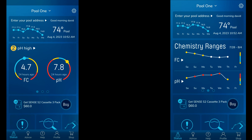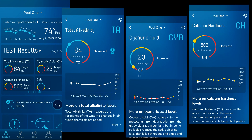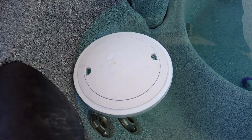Here are the readings for the week. Once I lowered my salt production, the free chlorine level has been dropping. On Wednesday I added acid to the pool, and you can see that reflected on Thursday with the pH at 7.8. Total alkalinity has been pretty consistent, cyanuric acid has been pretty consistent as well — although there were a few days where it dropped pretty low — and calcium hardness also seems to be pretty consistent.